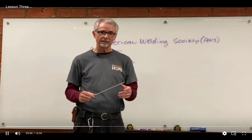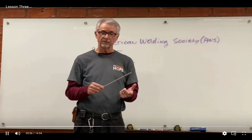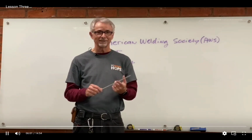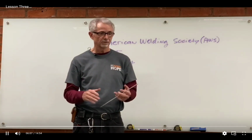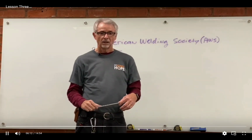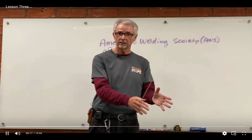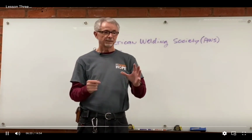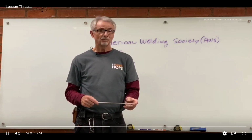So when you get certified as a welder, you get certified in a particular process. So you could be certified in MIG welding, but that doesn't certify you to stick weld. That doesn't certify you to flux core weld. That doesn't certify you to TIG weld. If you get stick certified, that doesn't certify you for anything else either. So it's certification by process. Also, it's by metal. So you might be certified to weld steel in a particular process. You might be certified to weld aluminum in a particular process, but getting certified in one doesn't certify you in the other.